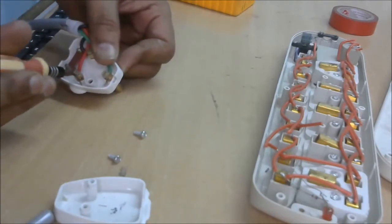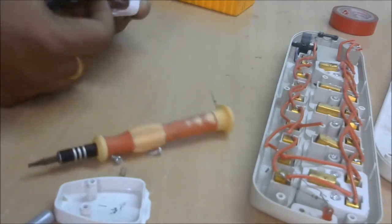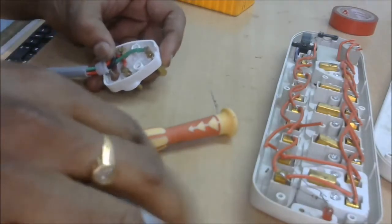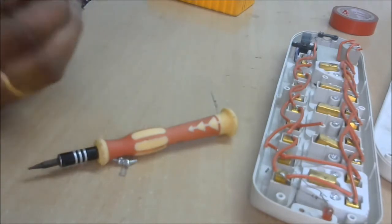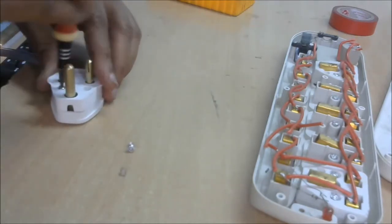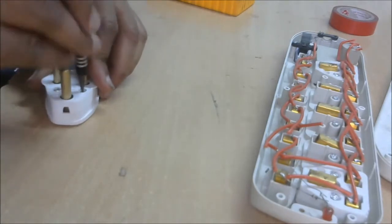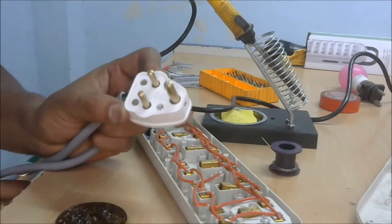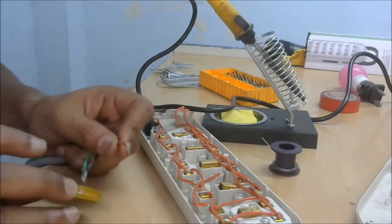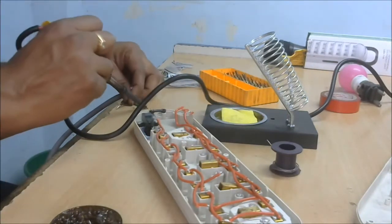Once you check that all three screws are fully tightened, lightly pull each wire to test. Keep the sleeve this way and close it — tighten both screws. Fit the three-pin black socket. On the other side, take the three color wires, apply some soldering paste, and fix gently. Take the soldering wire and tin-coat (lead) those wires.